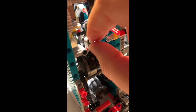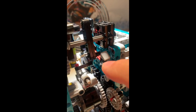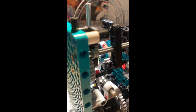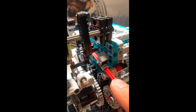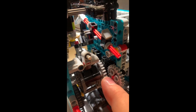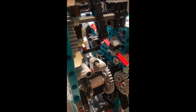So this second lever sits freely on this wheel, which is still locked by the second lever so it cannot move. When the full hour approaches, the second lever falls down and the mechanism is free to run. It runs as long as the first lever falls into this gap and locks it once again.